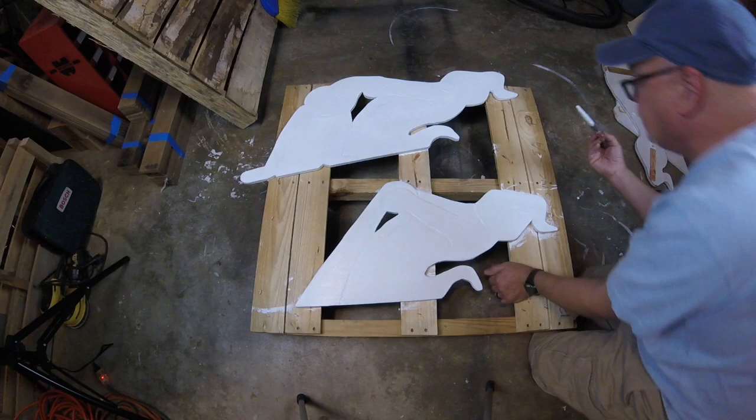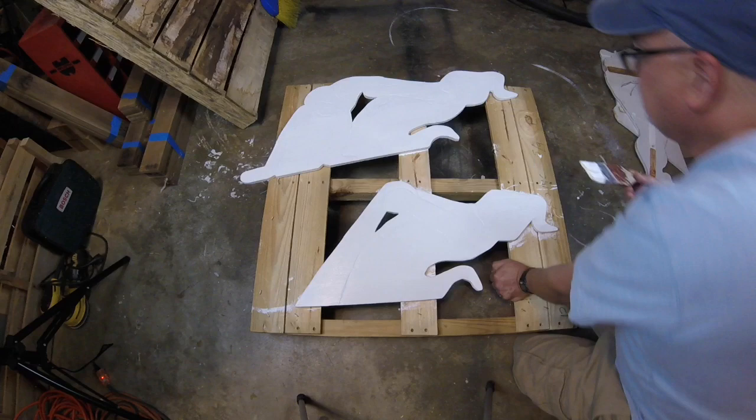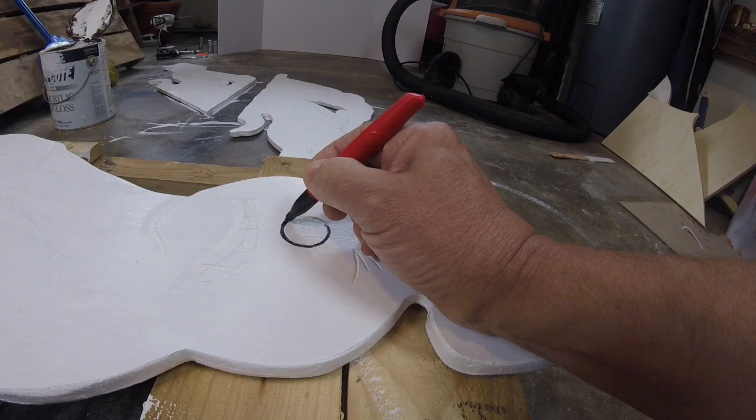Painting the edges is the most important part. I'm painting with this exterior paint on the edges — the top edges where the rain would hit, or the bottom edges where moisture might seep in. That is the most important part of the paint's job.